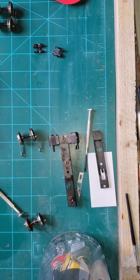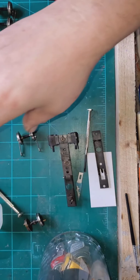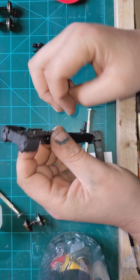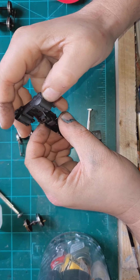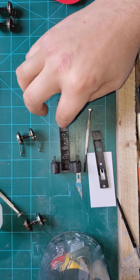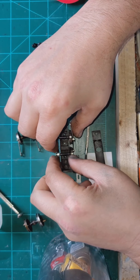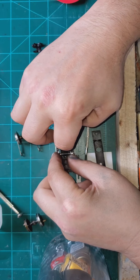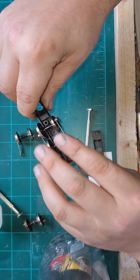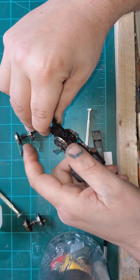Alright, let's put them together - this should be the final step. We have a little bit of oil for oiling. Went ahead and got that put back together. Paint stripped off whenever I went to clean the oil but I still like the color - going to leave it like it is. First things first, let's turn it over. Got these two cleaned, let's get them dropped in first. Check the quartering on them - they look pretty good. Hopefully no quartering issue, and they seem to turn without binding.